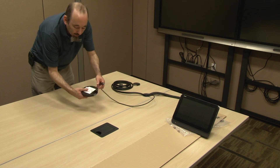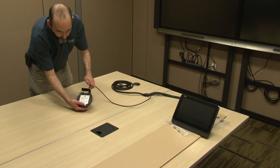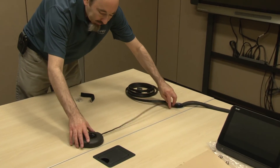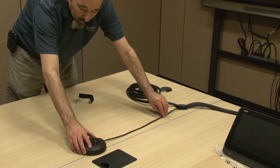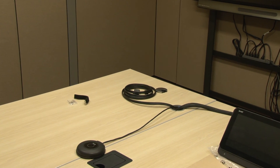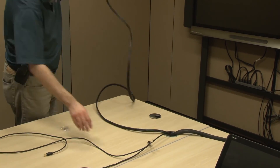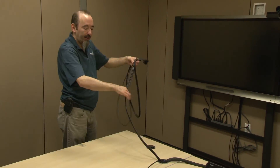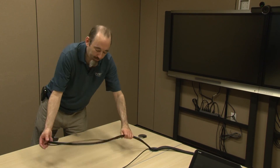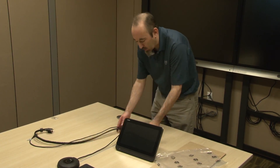Route the microphone cable and the guest computer VGA and HDMI paired video cable from the underside of the meeting room table to the top. The guest computer VGA and HDMI paired cable should be labeled with an orange sticker. Plug in the table microphone and position where desired on the meeting room table. If the USB bridge cable has been included with a specific system model, also route the guest computer's USB data cable between the top and underside of the meeting room table and connect it to the USB bridge under the table.